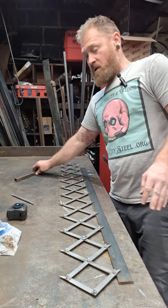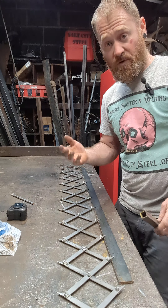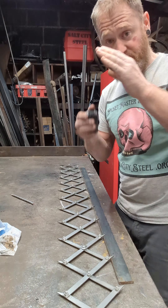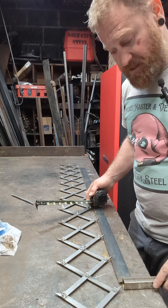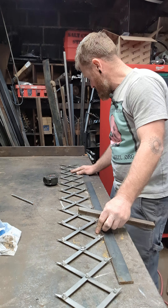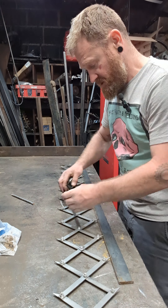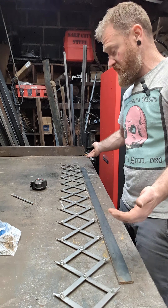We're gonna use a three-quarter inch picket, so our max space we can have is four and three-quarters to be in code. Because everywhere, the code is usually four inches max — so little heads don't fit through. Right now on one end we have a picket hanging over, and on the other end the same, because you got to make sure you keep your ends the same. You gotta add one on the end. Right now we measure that out — we're at four and a half. So if we took one away, we'd be out of code. So we know we're there.